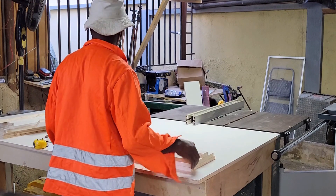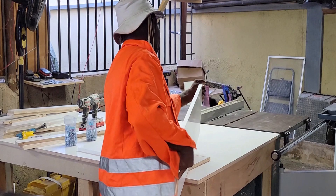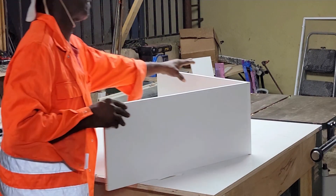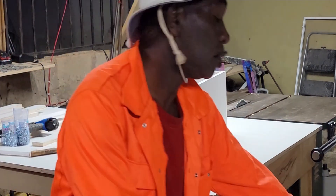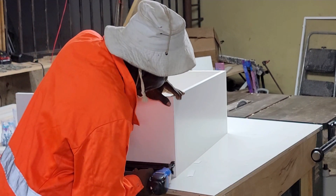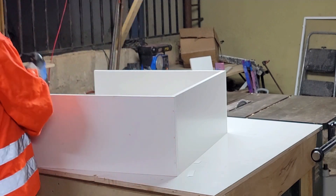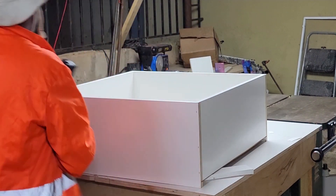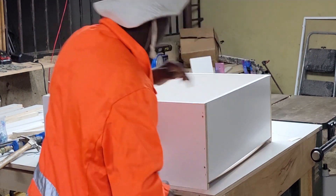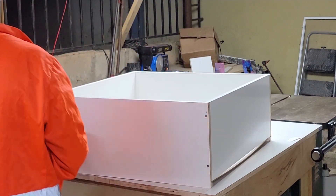The upper cabinets are built the same way as the lower cabinets. The only difference is that the upper cabinet has a solid piece at the top and a solid bottom. It also has a hidden cleat at the back — the cleat enables me to nail the upper cabinets to the wall. Now let's see how I build my upper cabinets.